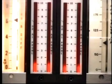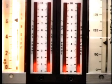Is there any way that we can reduce the negative effect of vanadium? Well, yes. One way to reduce the formation of vanadium pentoxide is to reduce the amount of excess oxygen which is available for combustion. But this is something of a trade-off. As we know, if we reduce the excess air too much, we run the risk of causing incomplete combustion.